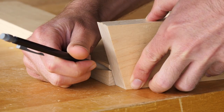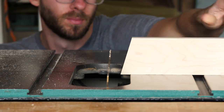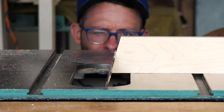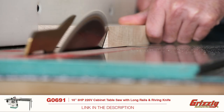Here I'm transferring the angle of the miters I just made to the horizontal pieces. Then I'm going to take them over to my table saw and tilt the blade to match the line. In theory, I could just set the blade to 15 degrees also, but there's usually some error involved, so it's actually easier to just eyeball it and dial it in for this sort of application, at least in my opinion. Then I cut a bevel on all of the horizontal pieces so that they matched the miter cuts.